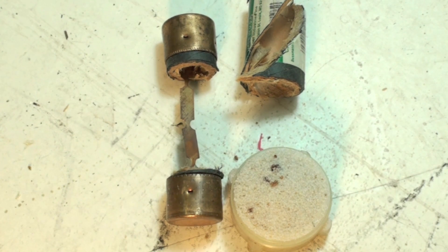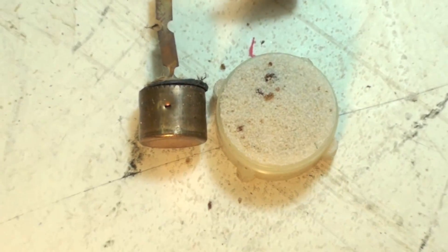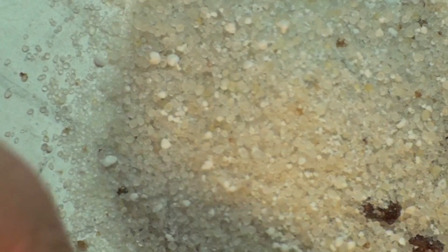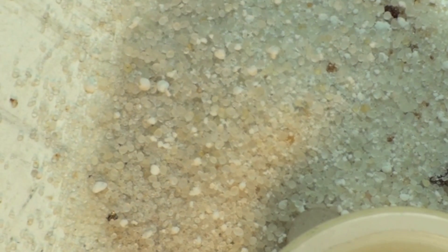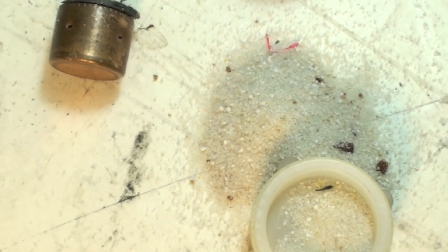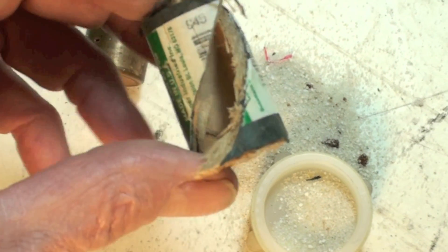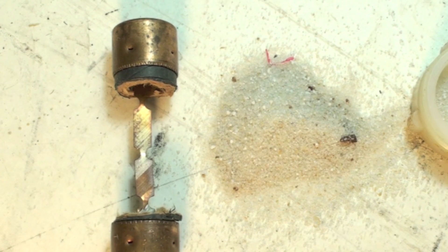Here's what this thing looks like when it's torn apart. First, I'm going to look at this little container of stuff. It's full of what's like sand — probably silica, or sometimes diatomaceous earth. This stuff doesn't burn, and that's why they use it, because fuses can get very hot. They don't want the fuse itself to catch fire — the casing is made out of cardboard, which is flammable — so they put that material in there to stop fires.